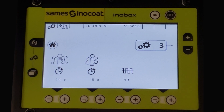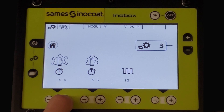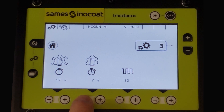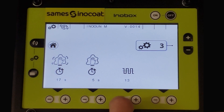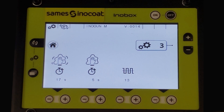Page number three is the active cleaning cycle parameter. The first item is for the active or turned-on phase of the cycle. The middle section is the setting of the inactive or stop time of the cycle. Use the plus and minus buttons below each symbol to increase or decrease the time, displayed in seconds. The third symbol is to set how many cleaning cycles you prefer, also using plus and minus to increase or decrease.